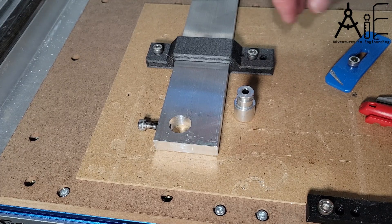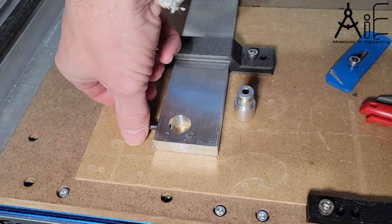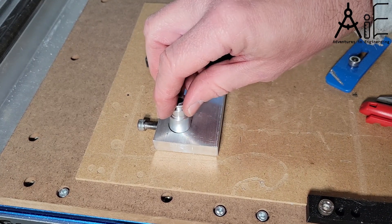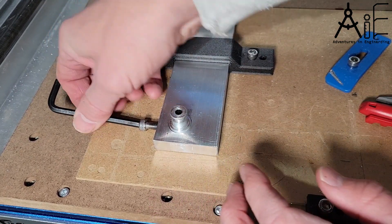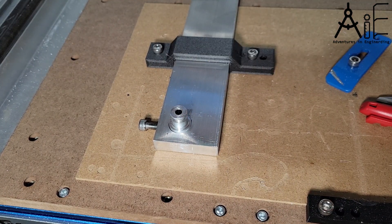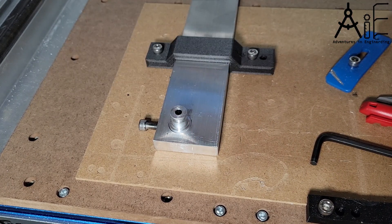Here's my completed part — a round hole and a square peg. The set screw will hold this thing in place. I can drop the round stock in here and tighten it down so it won't go anywhere, and then I can do the mods I want on the center of this cylindrical part. That's it — that's the video for the day. Hope you enjoyed this and found something useful. Be sure to subscribe if you want to see more content. Thanks!